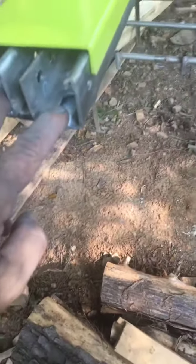I still have to go back and drill some holes inside here wherever one of those plates are at, because what that's going to do is attach to the top of a log. Once I get one side milled I can roll the log over, take the rail system off, roll the log over, fasten it down, get my measurement where I want to cut the other side, and go ahead and mill it. This way I can wind up getting me beams and stuff.